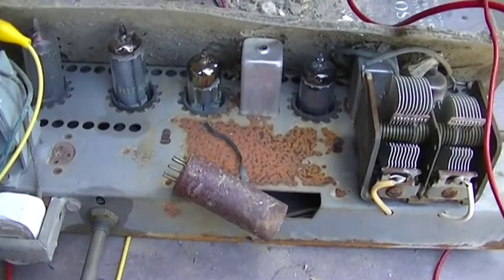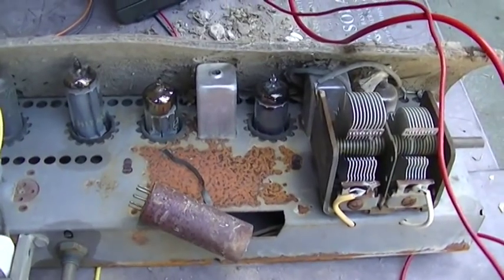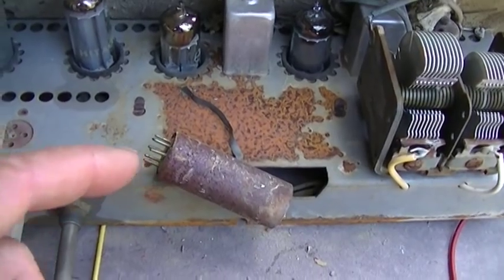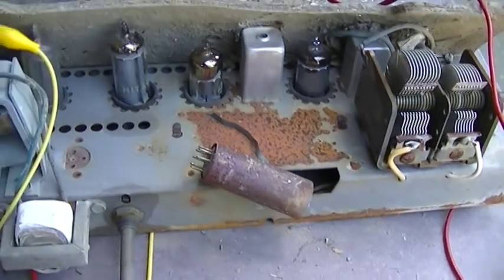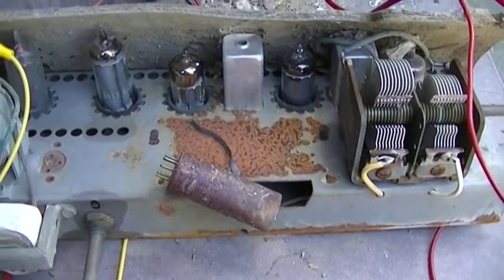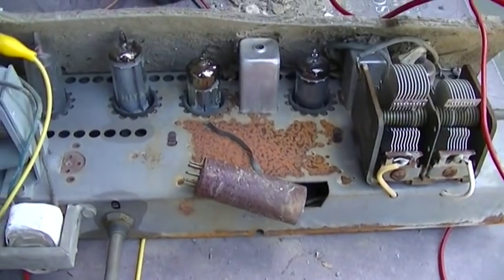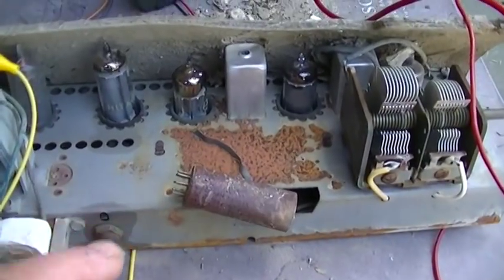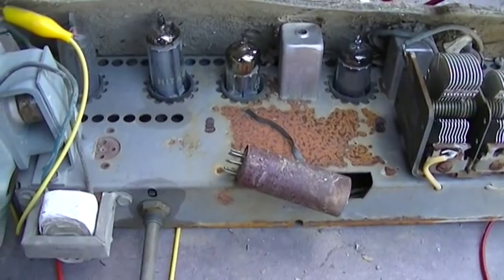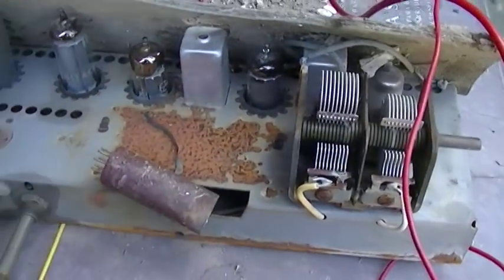I changed to 12AV6. Like I said, I've noticed that when tubes are exposed to water, the water gets up through the pins, it breaks the hermetic seal, and they go to air. That's why I wasn't so gung-ho to grab all that stuff, because the tubes go to air when they get wet. If you ever come across a box of tubes and it looks like they've gotten wet, throw them in the trash. They're not worth your time.